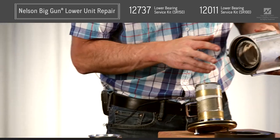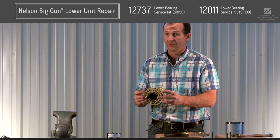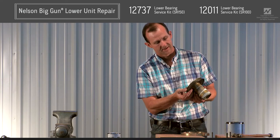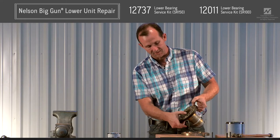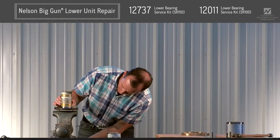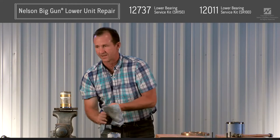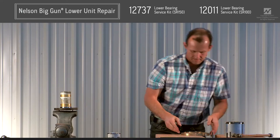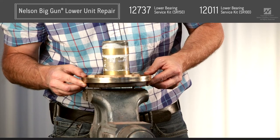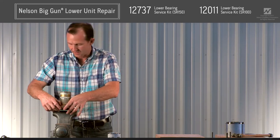To put the sprinkler back together, I'm going to put the seal back in the cover, then move back to the vise and employ the 5/16 screws. First, install the brake ring — it's got four lugs and you simply press it into its mating piece. The lugs should be in one of the two center holes between the two threaded holes. Once that's set up, put it back in the vise and tighten it down. You'll probably want a few shop rags handy because the grease tends to move everywhere. Take the cover and slide it right down — the upper seal has a little lip on it that you'll have to press around its mating parts, tucking it in with your thumbs.